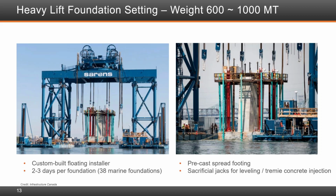So one of the things that we had to do was install shields in sheet piling of forms so that it allows for a working place where the current is not very fast. That was an issue. Obviously, we knew about the cold conditions, but as you can imagine, in winter, working in there with the ice shelf being there made it very difficult, and we had to always go in with a contractor and break the ice shelves and make sure that they don't present danger to the workers and the workspace.